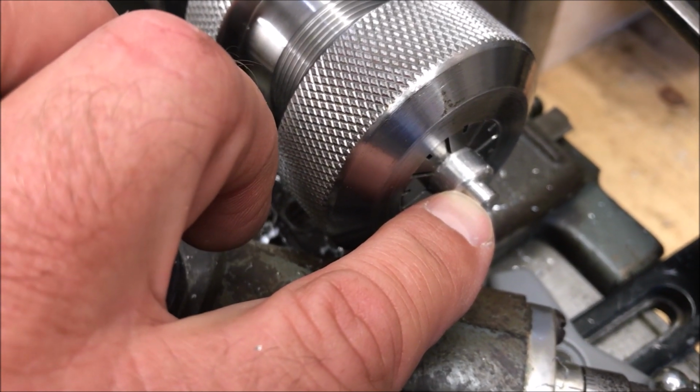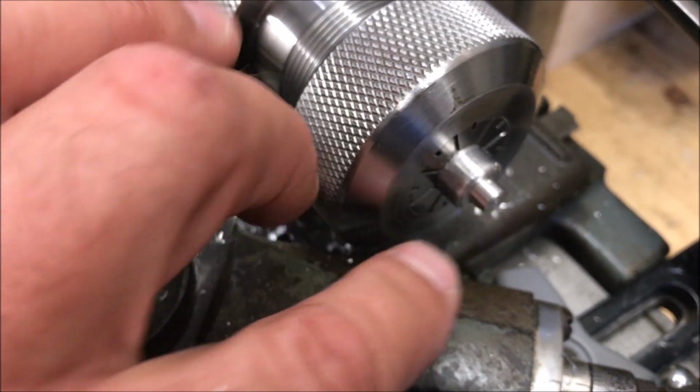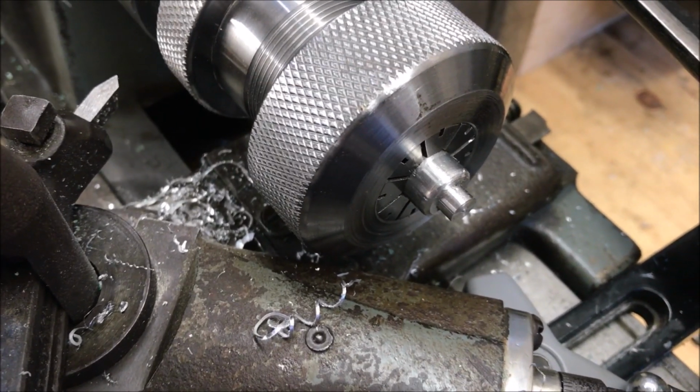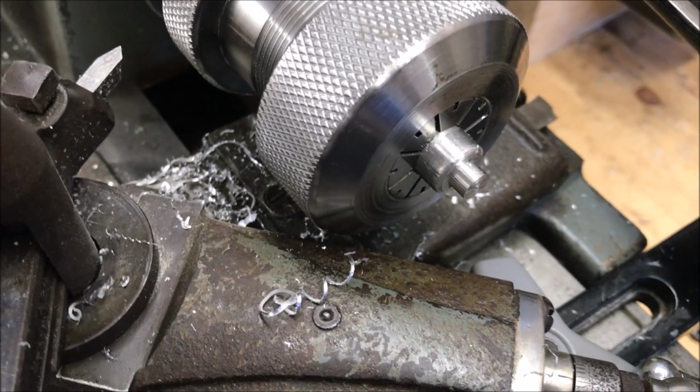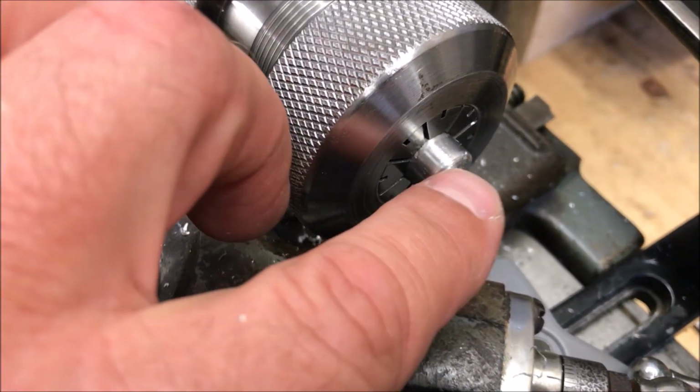The die I'm going to use is 1/4 NF28. So this is measured in inches right now, and instead of being 0.25, it's actually 0.26. It's a hair over, but I don't think that's going to be a problem. The die should cut right through it.